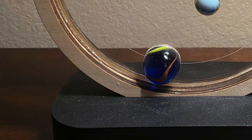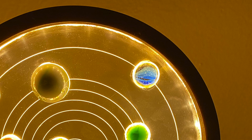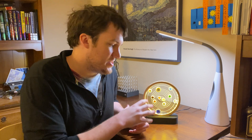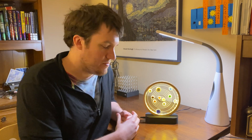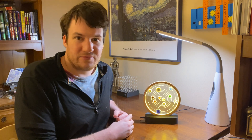Here's mine — you might recognize it as the thing sitting in the background in previous videos. I wound up not using the files that came with the original guide. I imported those into Fusion 360 but the dimensions were kind of wrong, so I just decided to make my own. They're not the hardest files — mostly just concentric circles. The big difference is also this base: I wanted a nice thick, high-infill PLA base rather than wrestling with laser-cut wooden parts.